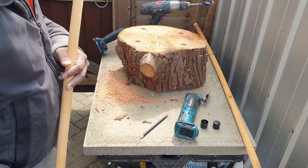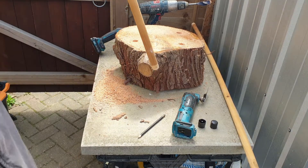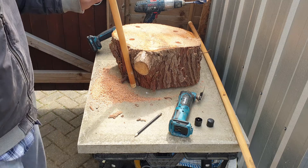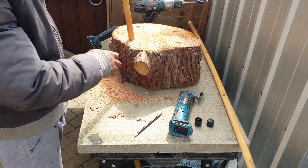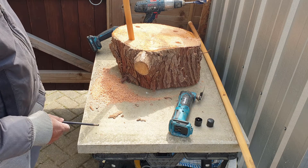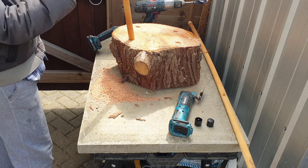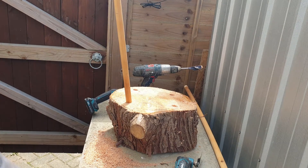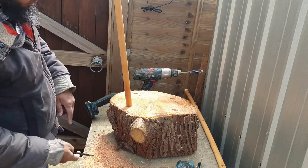The next thing to work out is how high you want your stool to be. I don't want it too high - there are children using it as well. That's the sitting area, so the legs are going to be this long, but they'll go into the log too, so you'll lose some height. You don't want to make them too short. Measure up to see how high you want it, because you'll need to cut them at the end to make sure they're all level. About arms length plus a bit more on top - so about there.